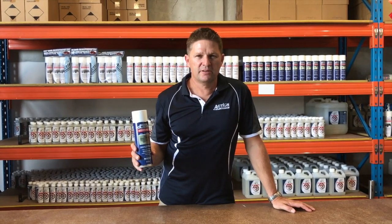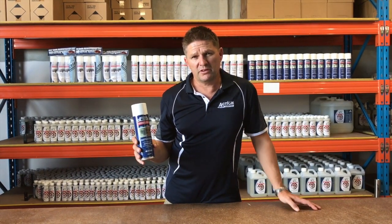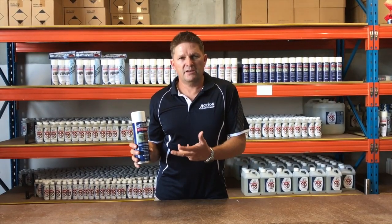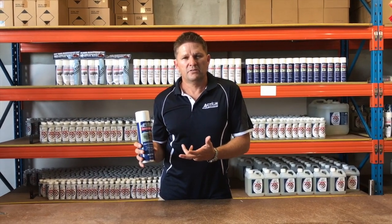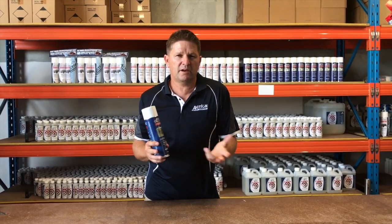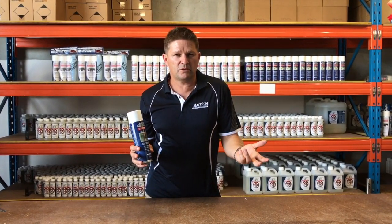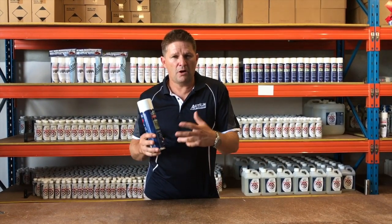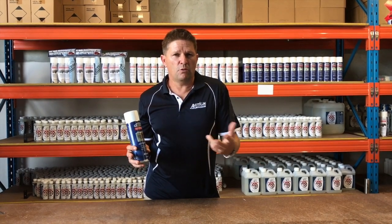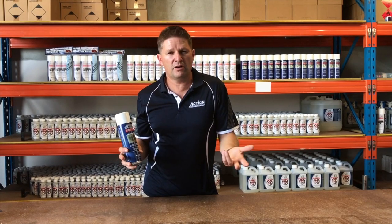Hi, my name is Josh Burnt from Action Creation. Today I'm here to introduce our new product ActionClear, which is a coating for the HVAC and R industry. ActionClear is a hard clear coating to protect external compressor units. There are other coatings out there which specifically protect components of the compressor unit — coatings for the coil, and oil-based coatings like Lanolin to protect the cabinet. The problem with these oil-based coatings is they attract salt and dust and can accelerate corrosion in the long run.